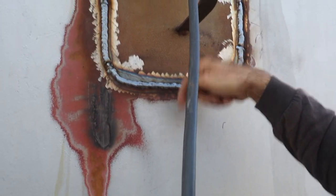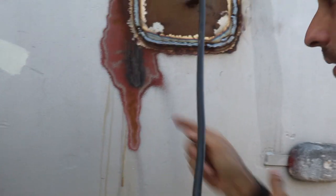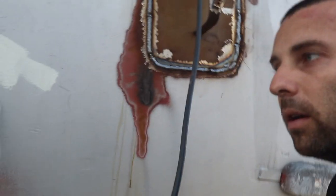So basically what that means is that the edge of the steel gets a bit hot, and the weld sort of falls down with gravity. I'm not happy about that, so I might do a bit of a grind in that and just fill that up with a weld across the top of there. And you've got to be that pedantic about these, because this is the hull, it's underwater, so...